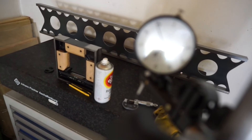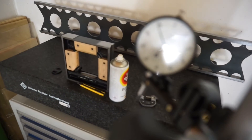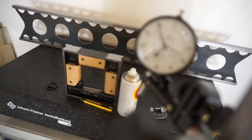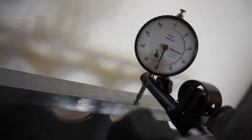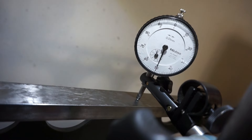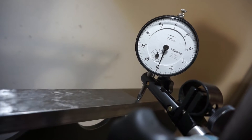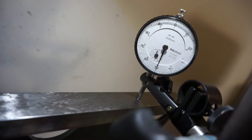Sorry about the strange view here, but I want to show you this test all in one go without a cut. As you can see, I have my straight edge on my surface plate. The straight edge is longer than my surface plate, and it is resting on two pins — one here and one here — in order to give this measurement a defined base. Now let's focus on the indicator and see about the straightness of this straight edge. Keep in mind that I cannot traverse the whole length; I'll go as far as I can without cantilevering the indicator base too much.